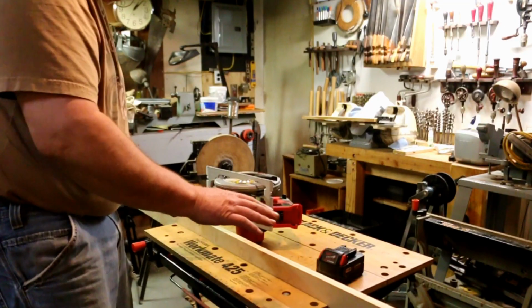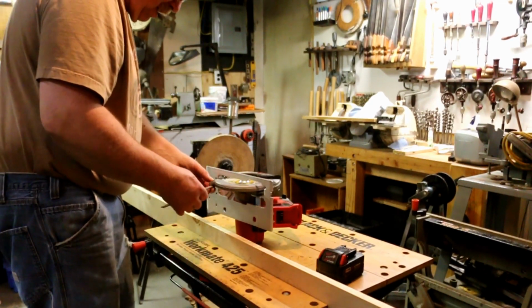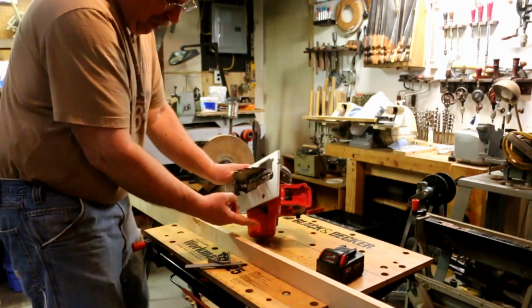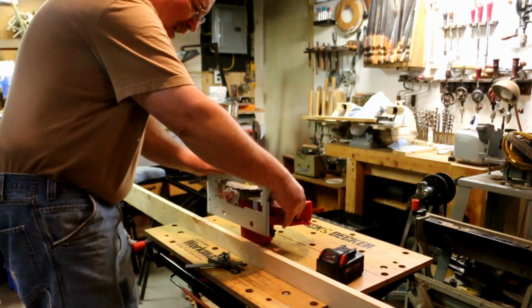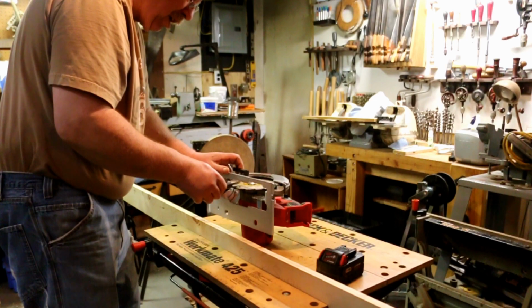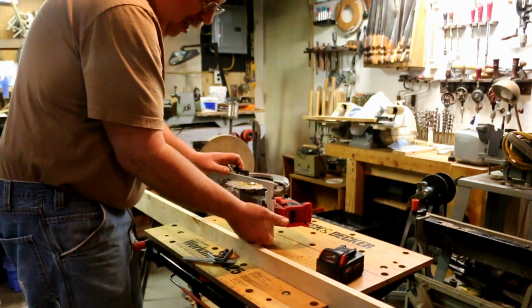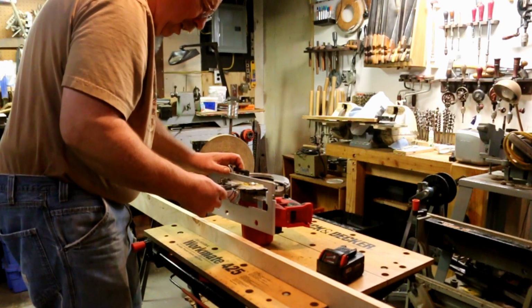The flange is not exactly flat. So right now, I'm going to set this to cut 1 1/4 inches deep. Loosen up the lever over here on the side. Most saws are set up similar to this. I have the square set up at 1 1/4 inches. I have one of the teeth pointed as far down as it'll go, and then I double check. Measure twice, cut once.